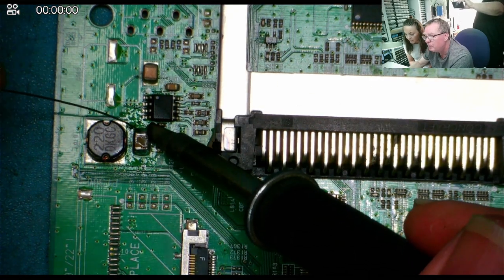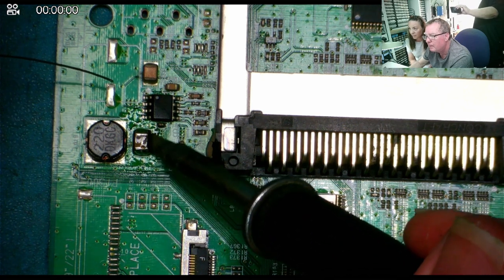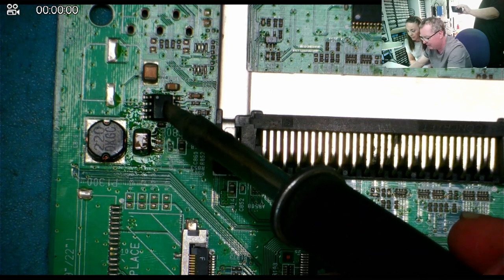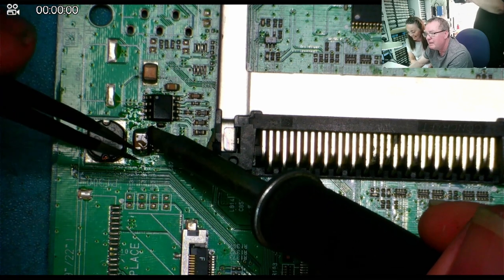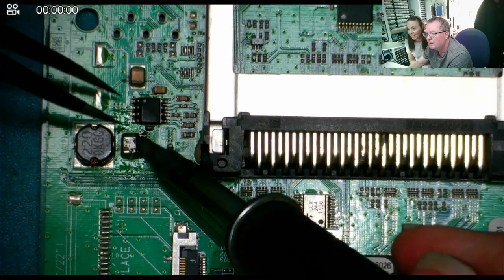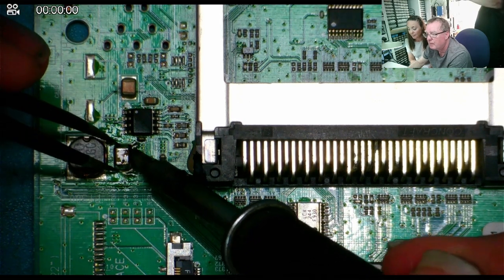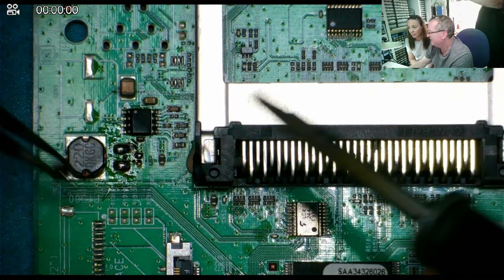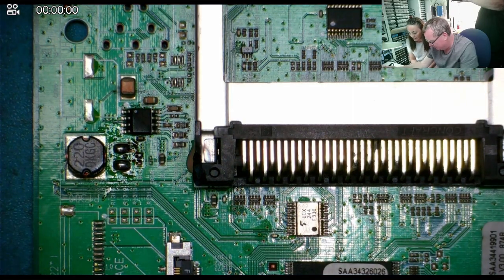That one isn't coming off. The way to do this if it doesn't come off is to get both sides at once. So what we do is we get a good big blob of solder wire on the end — a good blob. Now we can get in here — I'm sliding top, bottom, top, bottom. This one is taking some heat. Trust me to pick a tricky one. You're still not wanting to come off. We'll turn the temperature up on the solder iron. And — perfect! Got it. So you can see that can be a little bit more tricky.